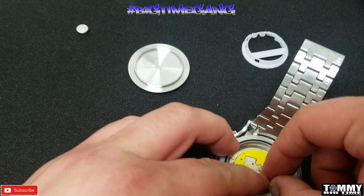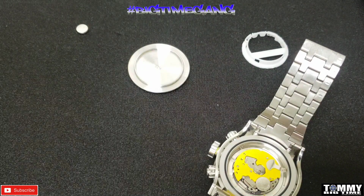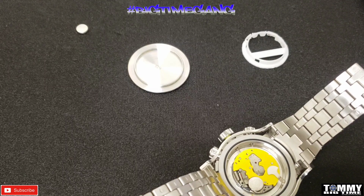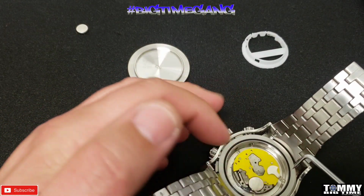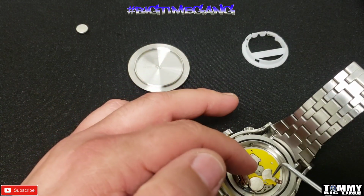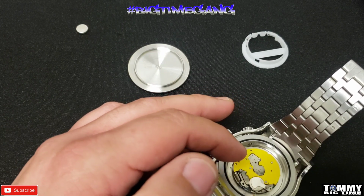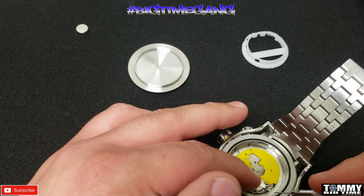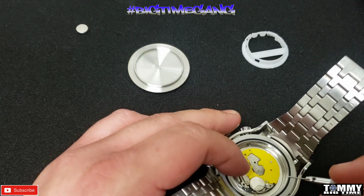Now, if you don't watch my videos normally, I try to say this in every video just in case. RENATA 395, RENATA in general, is the brand that I use for batteries if I can find it, because it's Swiss made. Most of these movements that you're switching out are Swiss made movements. And also RENATA is the brand that most of these movements come with from the factory. So I try to replace it with what actually belongs in the watch.